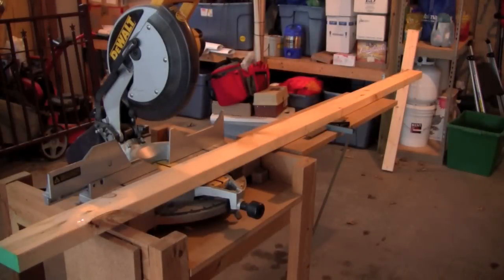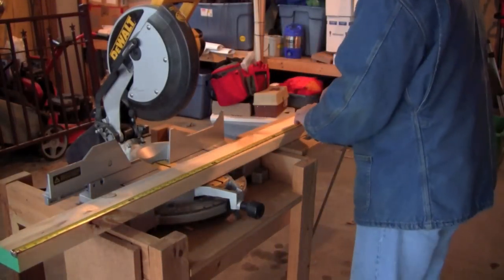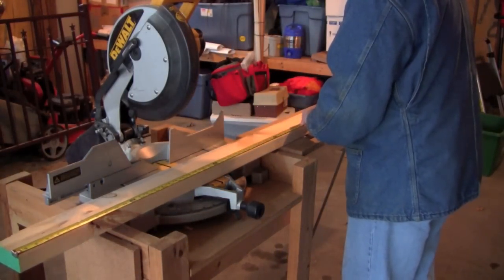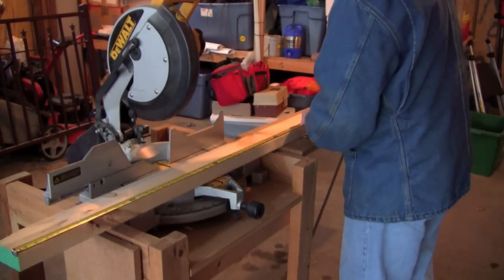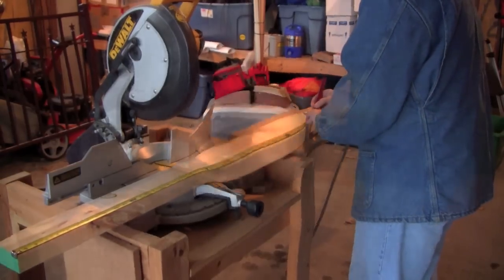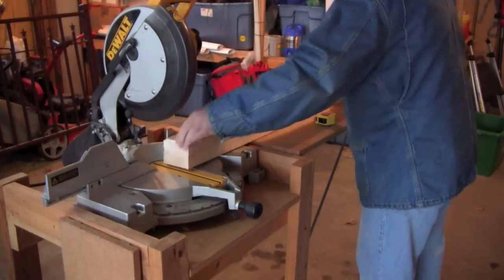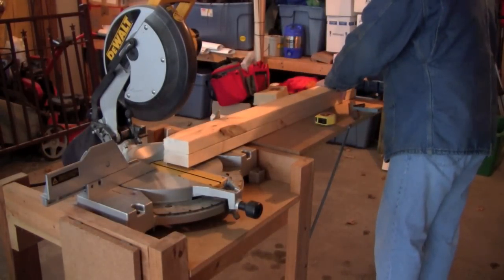I am going to demonstrate how to build a basic wooden stand for two 24-inch long aquariums. Start by cutting all the wood pieces you will need for the entire rack. When you design your stand, make sure that the dimensions will fit the aquarium you want to use in between the legs and solidly on the center of the rail.